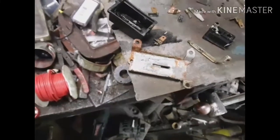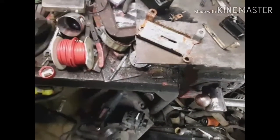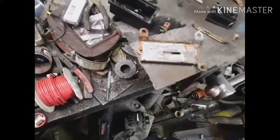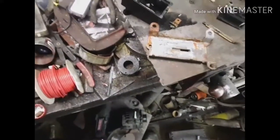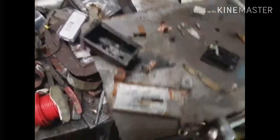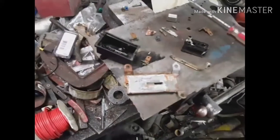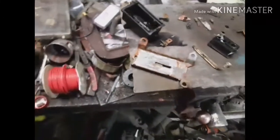No wonder this stuff didn't work. Now I'm going to try to clean all this up and put it back together. I'll show you what it looks like before and after cleaning. You can see the switch — everything's supposed to be grounded, but nothing was. The tips on those contacts are burnt up. I'm going to wire brush and scotch brite all of this and clean everything up.